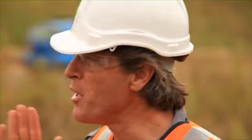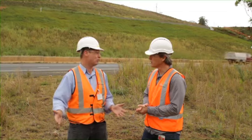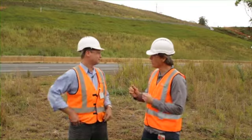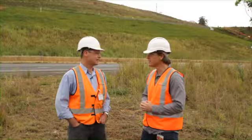Go ahead and build the rest. So we've done our field testing, we're ready to build. And we need to confirm that what we've built is the same as what we've achieved in the field trials. So then we do a whole suite of tests — maybe 0.5 or 1% of all the columns get tested. And those columns need to comply with our field trials. And if they don't, you've got to replace the columns. How often does this to-ing and fro-ing happen from the initial investigation to testing them and re-testing them? It takes months. You've got to do it thoroughly.